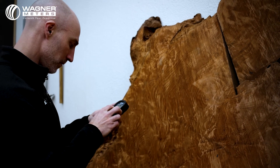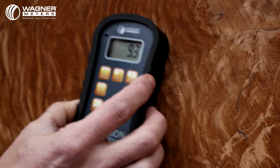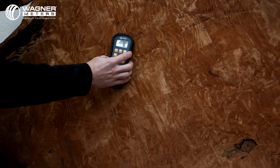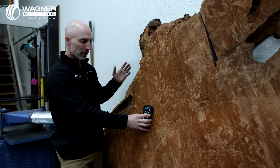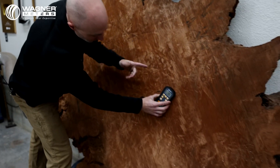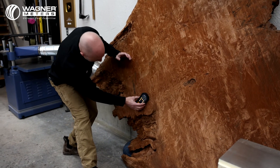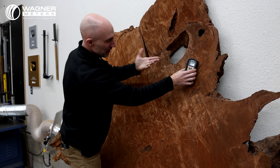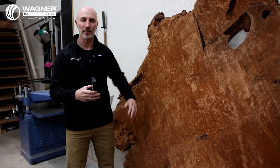As I understand it, you want some air behind the wood, and this slab is leaning against a wall so it should be just fine. You can see it's reading 9.3%. Moving it all around, this is basically textbook perfect for Oregon — and this slab came from California. A little bit drier is better than a little bit too wet; it'll equalize in your shop and soak up that little bit of moisture. The readings are really consistent: 9 to 10 and a half, and 9 to 11 is pretty much standard for Oregon. Good job, GL Veneer, a company down in California — it's really consistent, no pockets of trapped moisture, which matters in a pretty thick slab. And that's how you use it; that's how you check and make sure the wood is ready to work with.